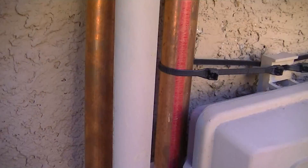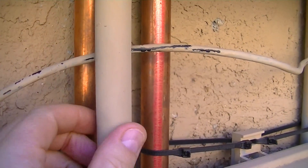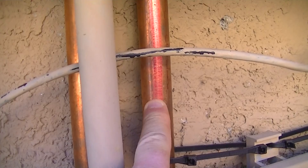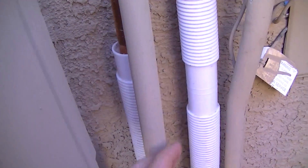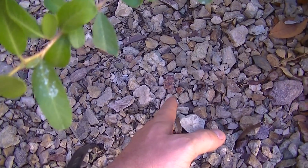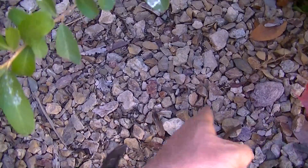What we're looking at is a three-quarter copper pipe, a plastic conduit that has a number four grounding cable in it, and another three-quarter copper pipe. These come down here, and you'll notice that everything is insulated from this point onwards. They come down to about here where the insulation stops, and then the copper pipes and the number four grounding cable come out and are in contact with the ground in this area.